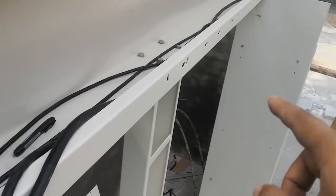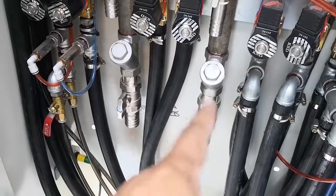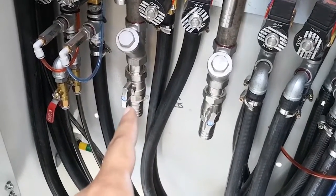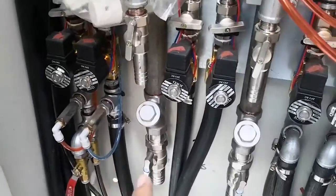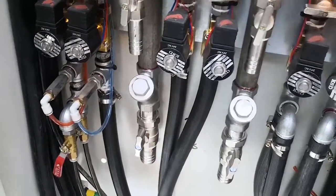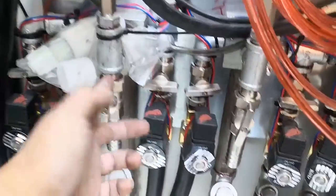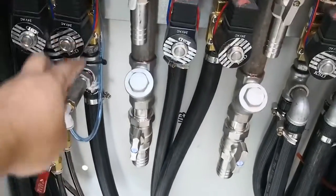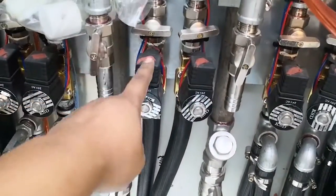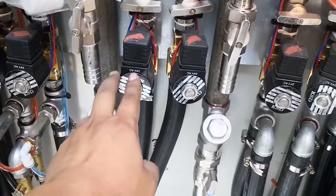And there's other connection in the box, 70, 71, 72. Here, a water pipe connects with the pumps. So, we have two underwater pumps. The 1.5 kW pump connects to this one, because this is the fresh water. Fresh water goes here, and sprays separately. This is the shampoo, goes to shampoo. This is wax. This is the fresh water as the last function, water function.